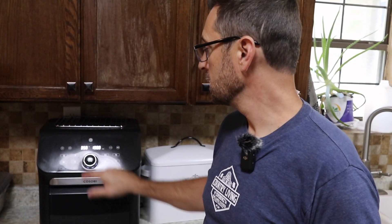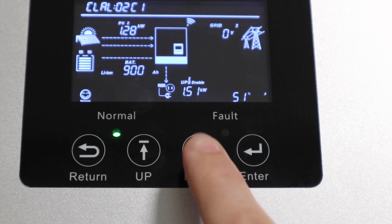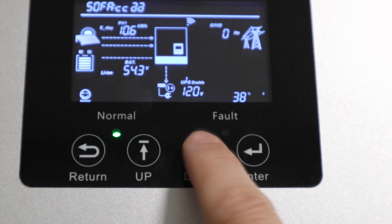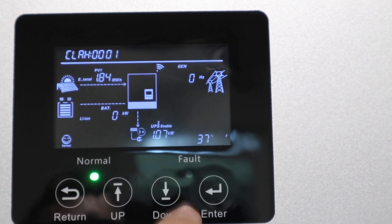Now let's head to the kitchen for a real-world test. With all the air conditioning on, if I needed water for coffee or tea I'd put the kettle on — that's about 1,300 watts. We also have an air fryer that doubles as a toaster, about 1,800 watts. With both of those running, we're at 51% and 40% capacity on the two inverters — about 1.5 kilowatts on one leg, 1.1 kilowatts on another, and around 1.1 and 1.0 kilowatts on the two legs of the second inverter.